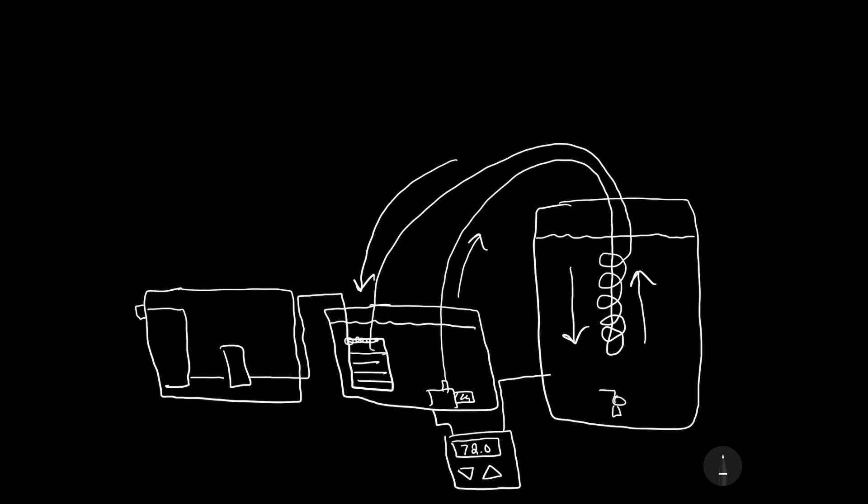My system uses a simple air conditioning unit for the refrigeration system. With a few modifications and a temperature controller, the evaporator coil on the AC unit can be used to lower the temperatures of a mixture of water and glycol. Another temperature controller will control the temperature of the glycol. When the glycol is warmed from the heat exchanger in the fermenter, the temperature controller will turn on the AC.